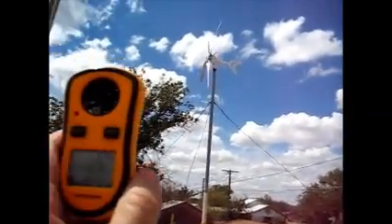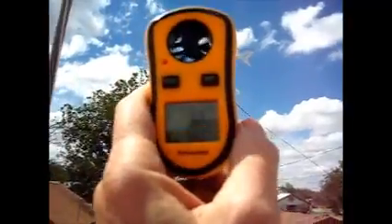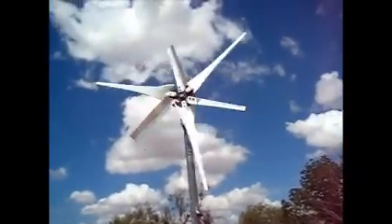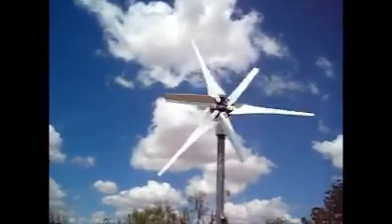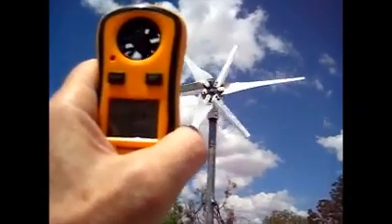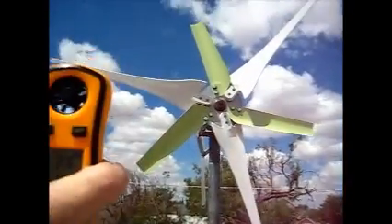These silver ones on the top were made by me and the lower ones I bought on eBay. These are just basically short aluminum blades designed to catch low wind speed. The longer blades, even with 6 of them, take about 7 miles per hour wind to get started. The eBay ones are starting at about 2 miles per hour.